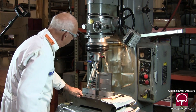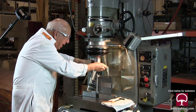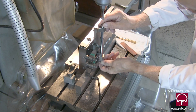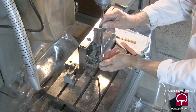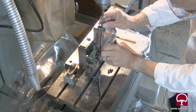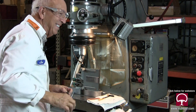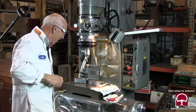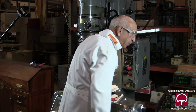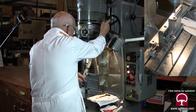We'll remove our arbor and see what we've got. Let's see how good this expanding arbor that we made works for us. We'll remove this hex bolt at the bottom — that should give us the clearance that we need. I can always raise this up. There we go, folks. Got it. Well, I think we're good to grind. The worst thing that can happen is we screw up the part, which I don't think is going to happen. We're going to have to feed this thing by hand to get it to do what we want it to do.